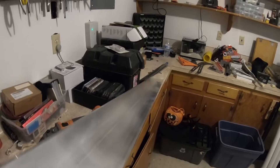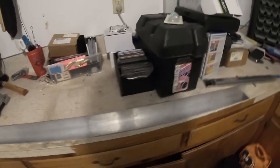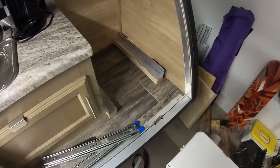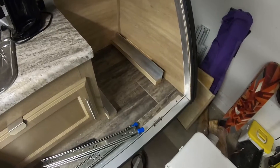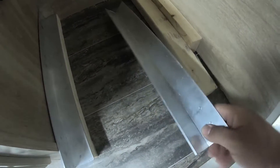You can see where I've got it marked here. We'll cut it with a cutting wheel on an angle grinder - you can use a hacksaw if you don't have one. I'm going to get two pieces out of that. Here we got them cut. I also ripped down a two-by-four to two inches, the same width as the angle aluminum.